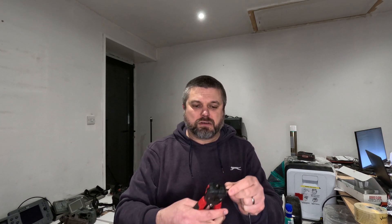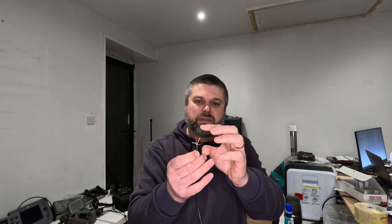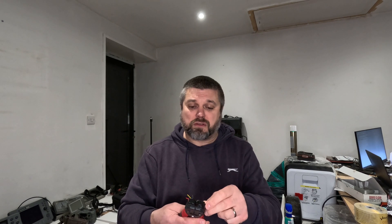What I've done is just use shielded cable - I'll stick a link down below and you can get it quite cheap, a lot cheaper than the other option. Basically you take a three-core cable, though you can get away with two-core because you use the shield as the ground. So you get yellow, white, and red. The four-core was because they had yellow and earth, yellow and red, which is the same as SeaTalk really. The whites are less relevant, but you can go for the cheaper option - they usually have the option of two or three core and it's the same process.